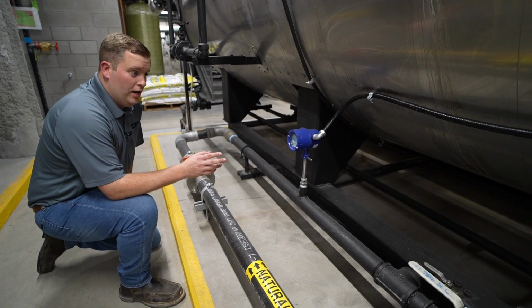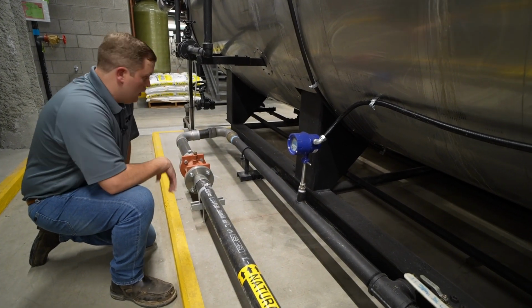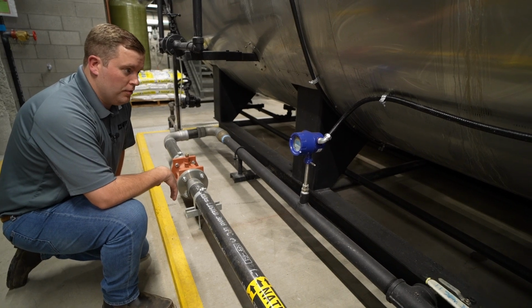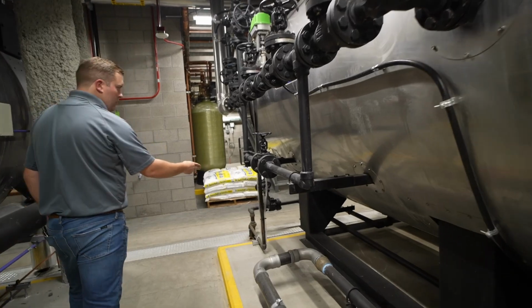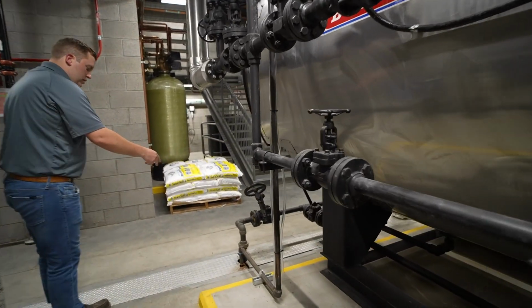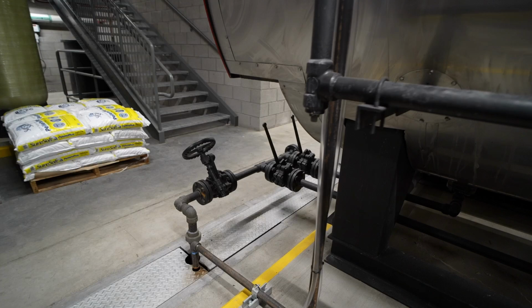So for code, we have 2 quick and 1 slow bottom blowdown valve. The connections are here, and they meet in the middle at a common drain that goes towards your blowdown separator on the other side of the room.